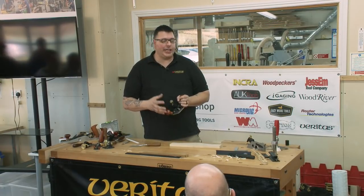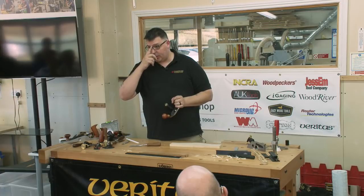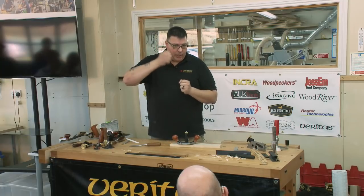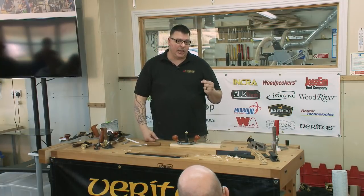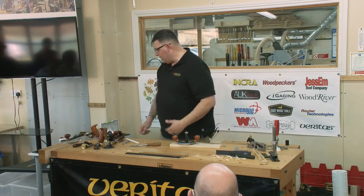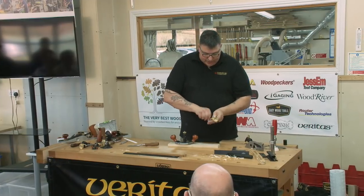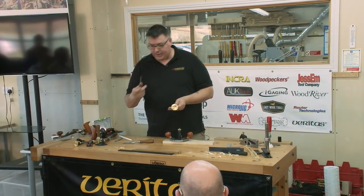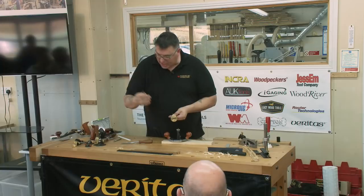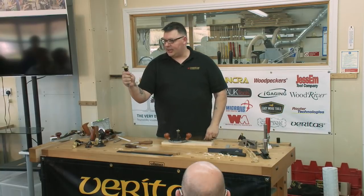Because if you're cutting a mortise by hand, each mortise is going to be slightly different, isn't it? It's nice to think that you're going to cut them all the same. But if you're doing it with a mortise chisel and you get a little bit of sideways movement as you're chopping, you may end up with one that's a hair wider. And again, this is the beauty of not measuring anything, because if I use a tool like this to mark my tenons, what I've done is I've taken my chisel, not that this is a mortising chisel, but, you know, I line that up so that the width is set exactly to this chisel, and then I lock those two bars together. And then now I can set this fence